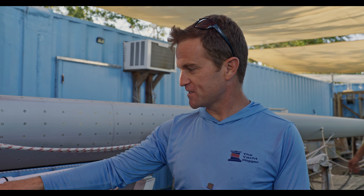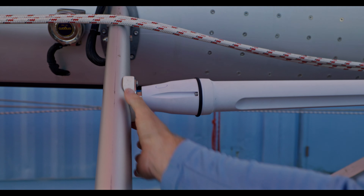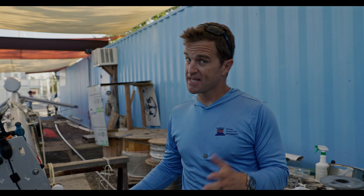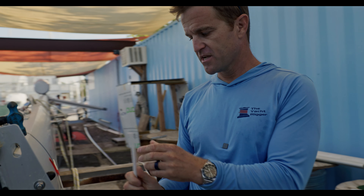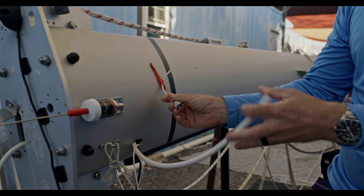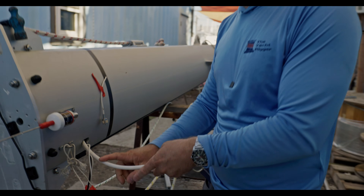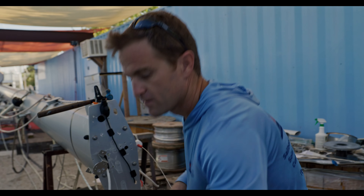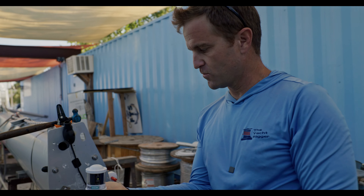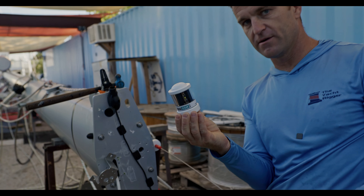Because of the curve on the spreader we had to make a custom mounting bracket for the antenna, otherwise it wouldn't make good contact. The antennas stand up perfectly straight. At the masthead, we upgraded the stock VHF antenna cable from RG-58 to RG-213 — a much heavier duty cable with much less signal loss potential. We also have the wind instrument and a new tri-color masthead light: a Windex and Plath OGM aluminum-body sealed LED unit, very high quality.